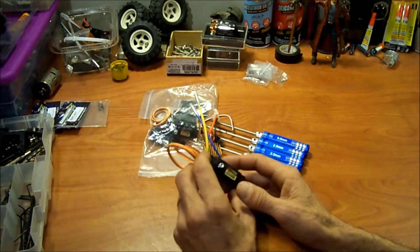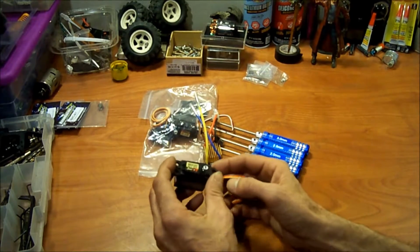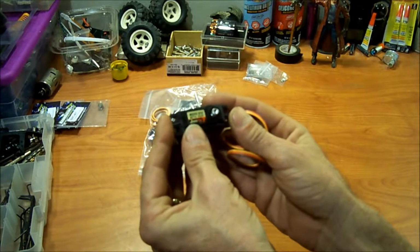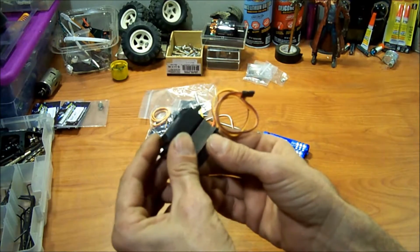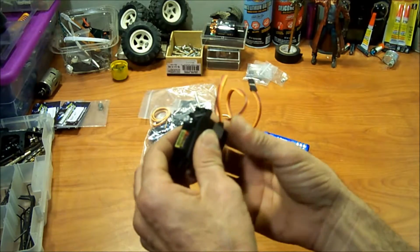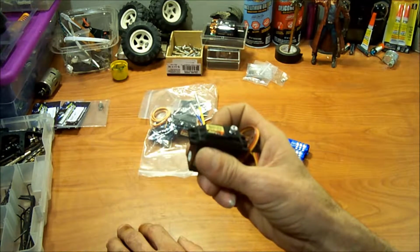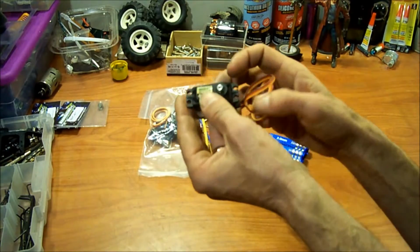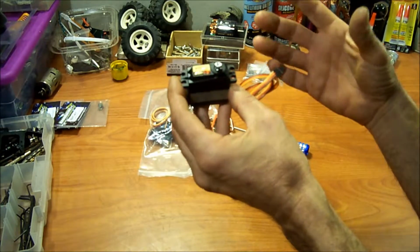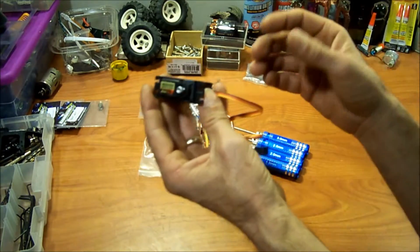And then I'm going to try these servos. Like I said, I got these servos cheap, and sometimes cheap ones are cheap ones. But we're going to try it out and see what happens. This one's a Tower Pro MG958 Metal Gear. I believe it's dual ball bearing, and I can't remember the ounces on it. They mark it as high torque, but it's really not high torque. That was something else I've been noticing. They might mark it as high torque, but that's its peak. If you can, see if you can find out what the continuous is. I'm not doing anything serious with this, just a couple projects I have. I don't have a ton of high performance servos, so I'm used to making do with stock servos. This should be a nice upgrade to what I have.